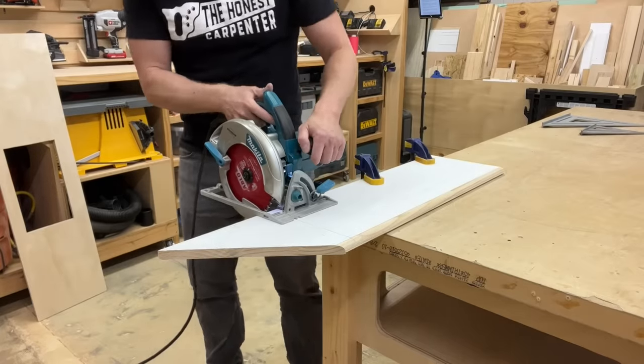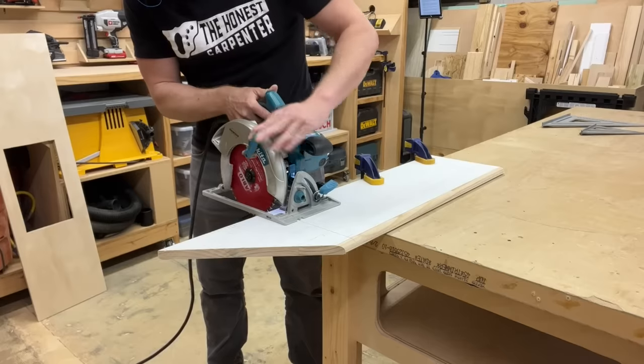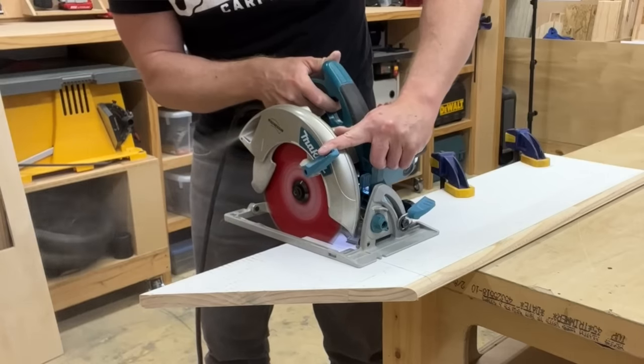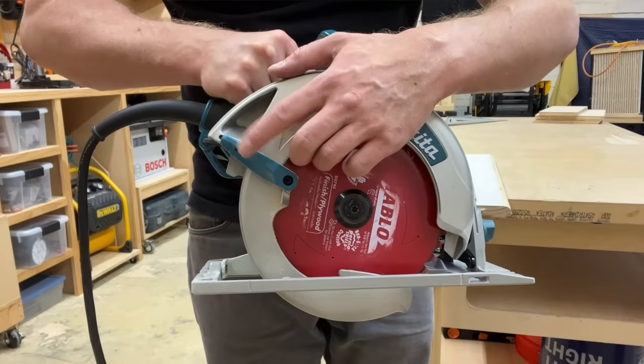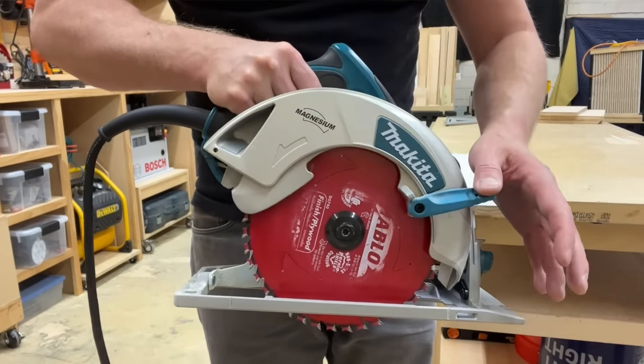This makes the cut feel much smoother and it doesn't have to strictly be used on angled cuts — sometimes I'll lift the guard on a cut where I just want to ensure accuracy. The process is always the same: get the saw supported, bring the blade close to the board, reach over the top of the hub, and draw the guard up carefully. Then when you're secure, pull the trigger and start the cut. Manufacturers put these little levers on circular saws so you can draw them up — it's part of their functionality.